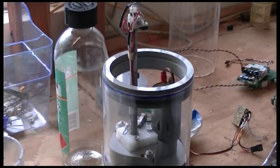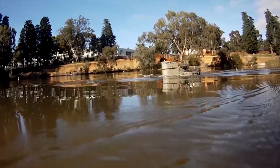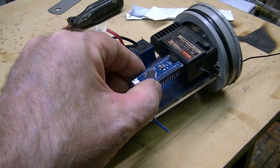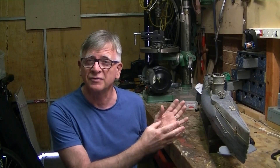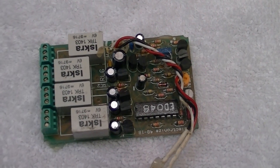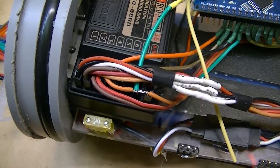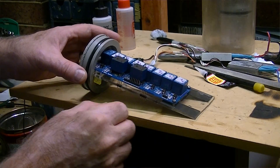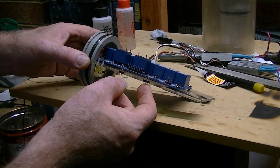I've already got on the web page a whole lot of videos about the build of it. I have rebuilt it internally, and the reason I've done it is because I have made a discovery as a modeler — I've discovered Arduino, which is a microprocessor that you can program yourself and put inside a boat. Instead of wires going from the receiver into various units or servos, most of them go straight into the Arduino, and out of the Arduino there's a bank of eight relays that control all of the functions of the boat.